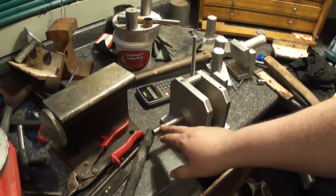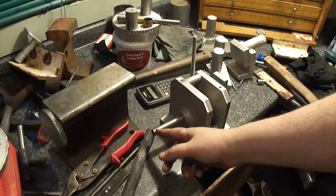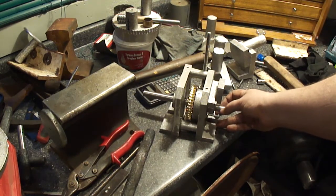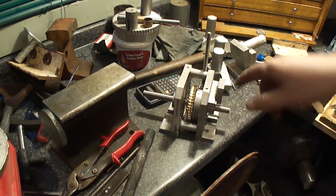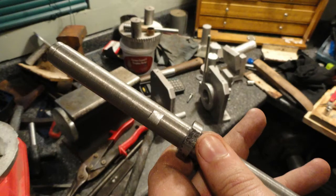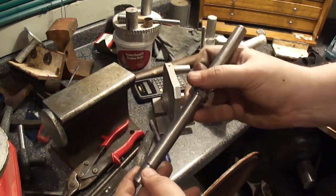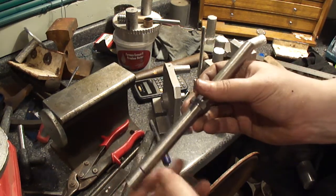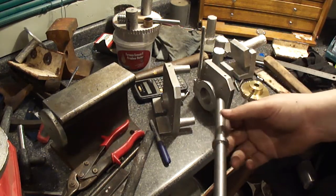It is a bit longer than it needs to be. I've got to take a measure off — two and a quarter inches — and cut it off or face it off to that point, then do a 60-degree point on it for a center. This will have to be cut down to size and a collar will have to go on here. I'll tighten up the set screw to figure out where to file the flat in it. I'll mark for the back side and turn it down, then do the 60-degree point right here, and this end will be faced off.